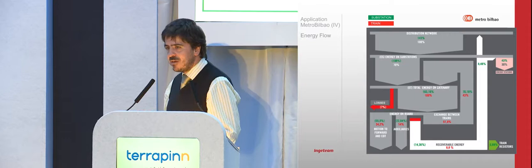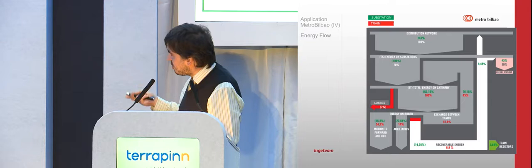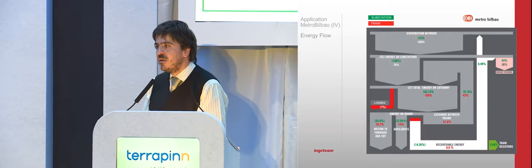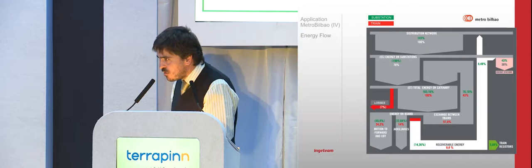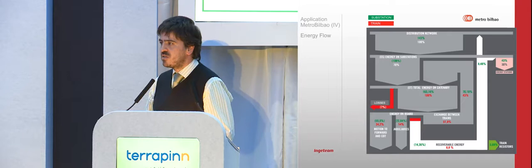But if we look at the issue not from the train but from the traction substations, since the trains take energy from other trains but also from the substation, this 8% from the train perspective becomes 14% of the traction bill you pay. So we analyzed where we could put the reversible substations, and we concluded that it was worth targeting a saving of 8.5% and letting the additional 5.88% be burnt in the resistors, because those were very peak powers that were not worth saving.